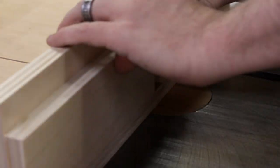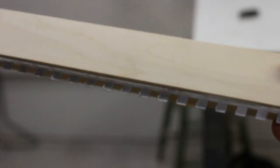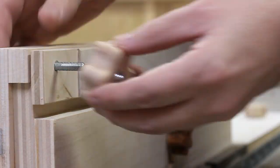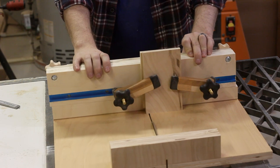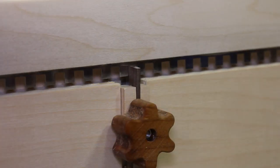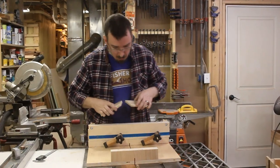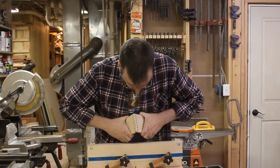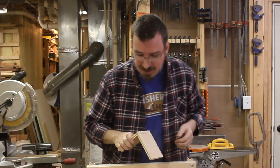Now I can test it out for the first time. I made a bunch of templates to use, but I was most excited to test out the new metal one. I pop it on and tighten it into place with some hardwood knobs that I made. I adjust the index key, clamp on the material to the top fence, and give it a try. The way it works is that after each cut, you nudge the top fence over one kerf width. When you can't move it anymore, you lift it up and move it over so the indexing key goes into the next notch on the template. And now for the test fit — perfect. I couldn't ask for a better fit than that. It turned out absolutely perfect. This has got to be my new favorite jig.